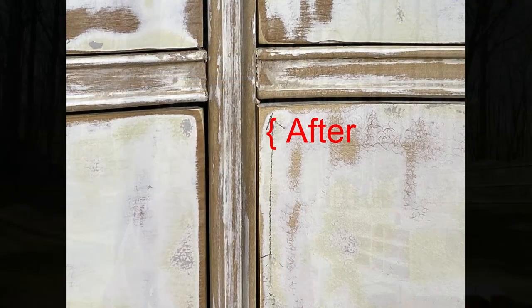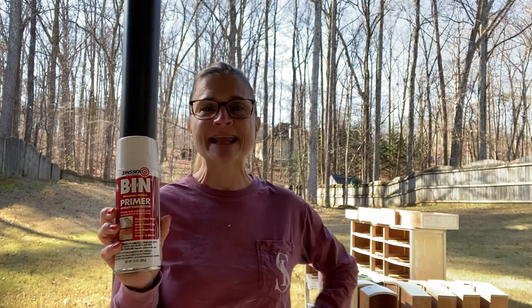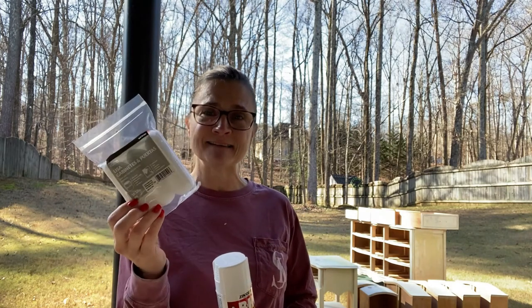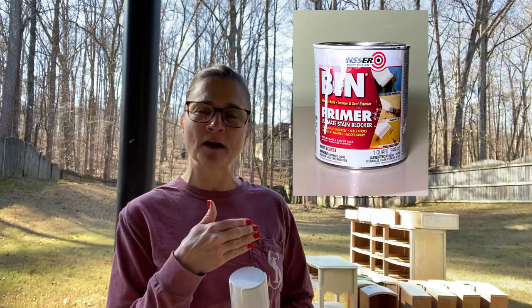See how tight this area was before I sanded? There's clearance now between the two surfaces. It is a glorious morning in my part of Georgia, so I have about an hour and a half and I want to start priming. I'm going to use the spray version of this shellac-based Zinsser Bin Primer to get into the detailed frame of the dresser body and also into the details of the drawers.